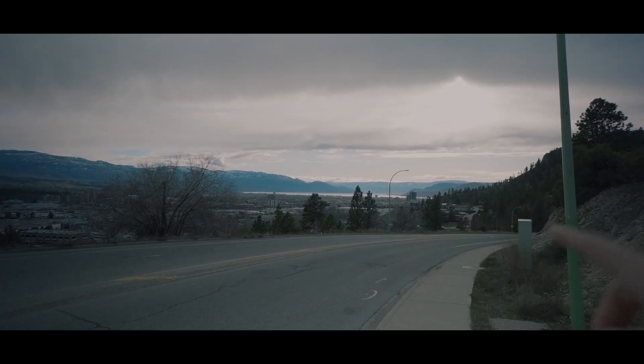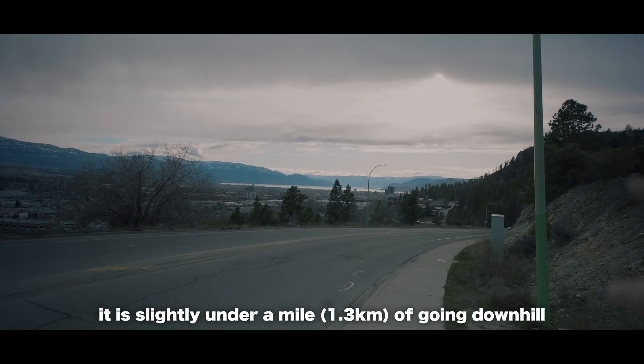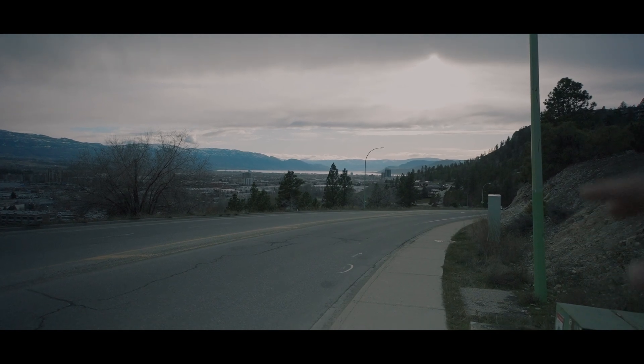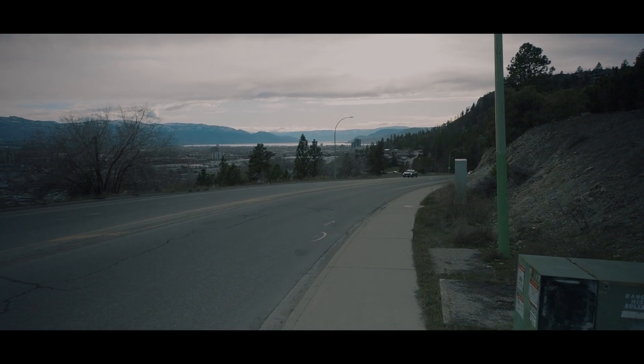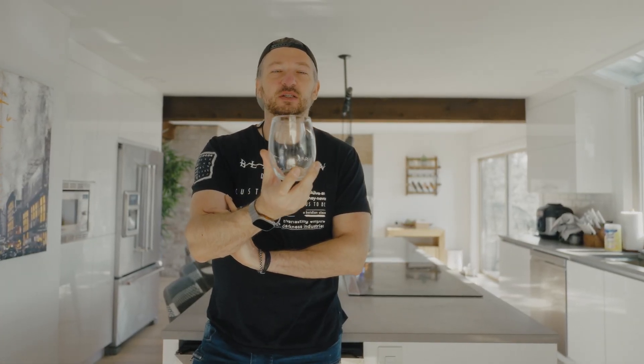It's a crazy downhill — probably 800 meters or even more going down — and during that downhill ride the wheel will regenerate a lot of energy, a couple of volts for sure. If it happens that your wheel is already charged to its full capacity, well, you have a lot of problems with that wheel, and I'll explain why.